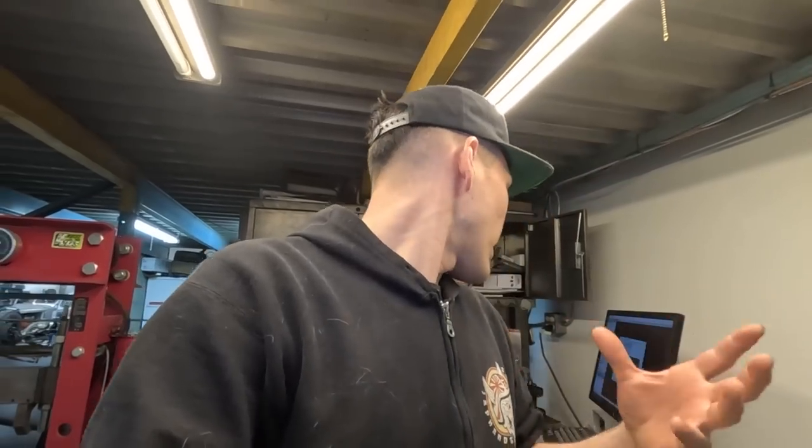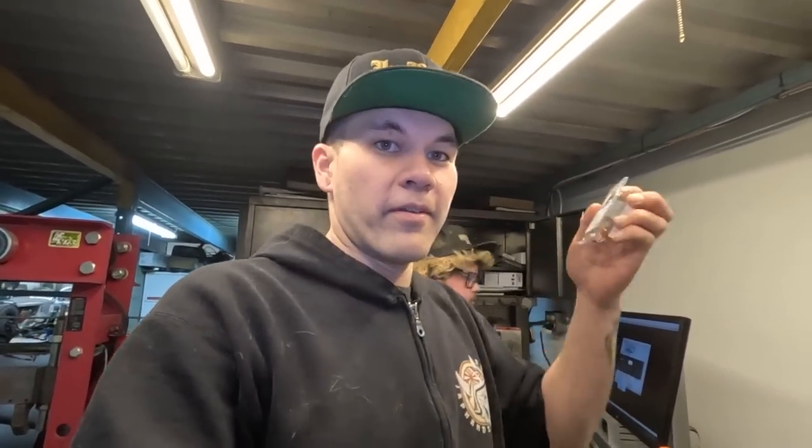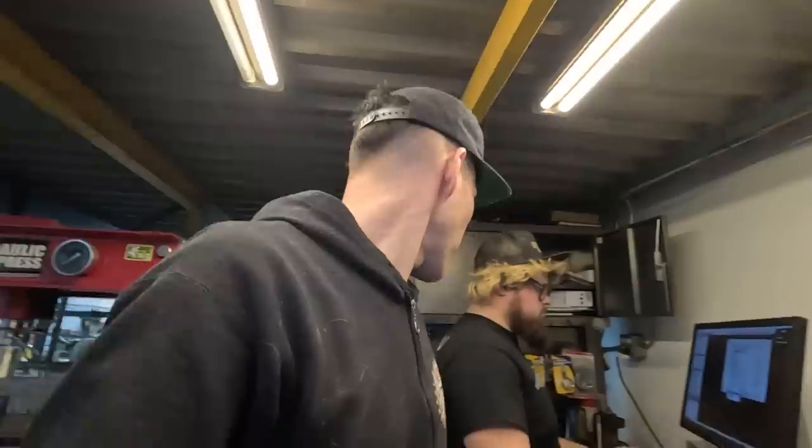We found out, Elio actually found out through forums and whatnot, that the reason for that is that they do not suggest using fine cut consumables on here because it's got sensitivity where the aluminum shavings get up in there and kind of mess it up. So we went and got 45 amp consumables, not fine cut. And these ones are supposed to work, and there are cut charts on SheetCam for it.